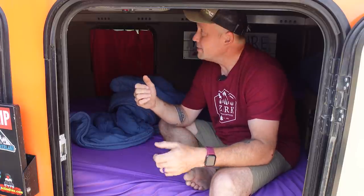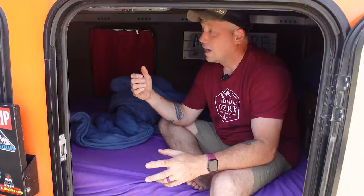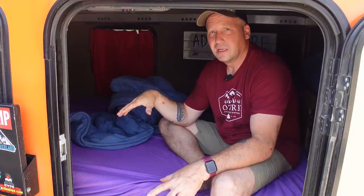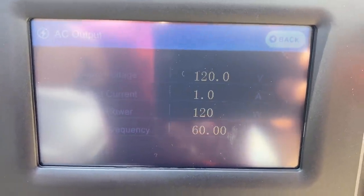What if you have a small teardrop trailer with an AC or a small RV and you don't want to be stuck without climate control during brutal summer heat? Here in Arkansas, it's currently mid-July with high temps and high humidity — nobody wants to be camping in a tent in this. We've got the camper plugged into the AC200P and the air conditioner on, and it feels great. It's currently pulling about 1,200 watts, so it won't last all night, but it can cool the space down before bed. Once the AC cycled off, it dropped to only 120 watts.